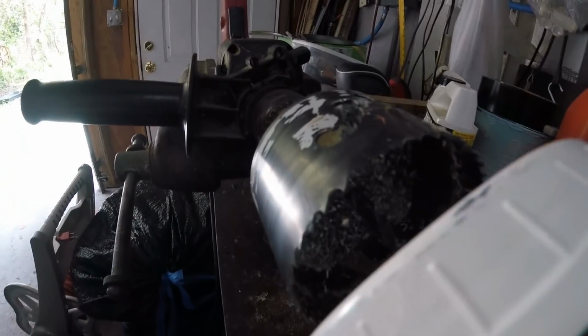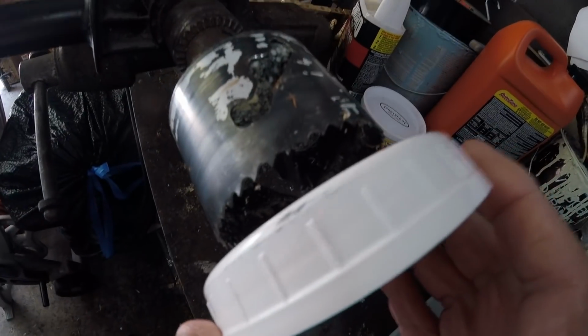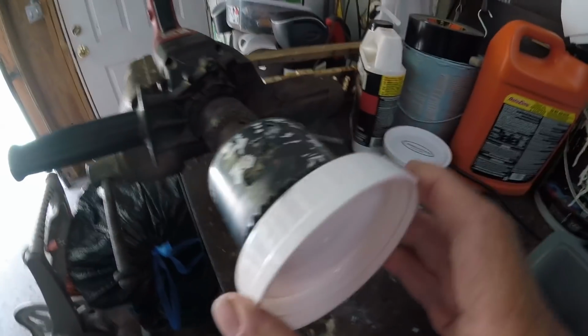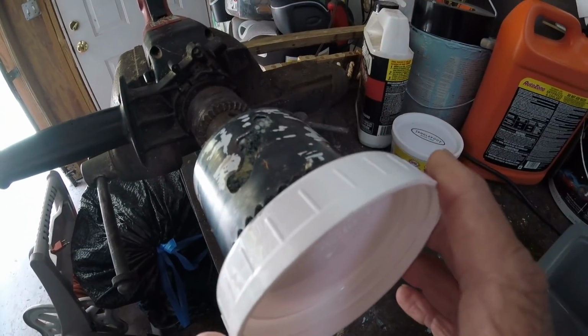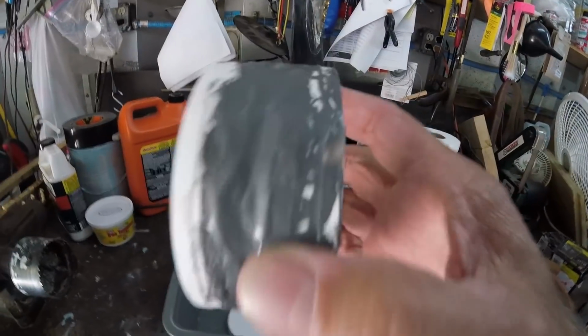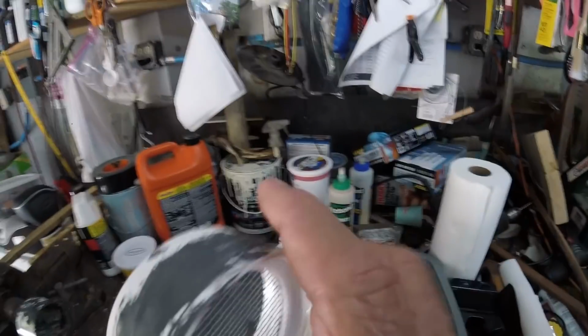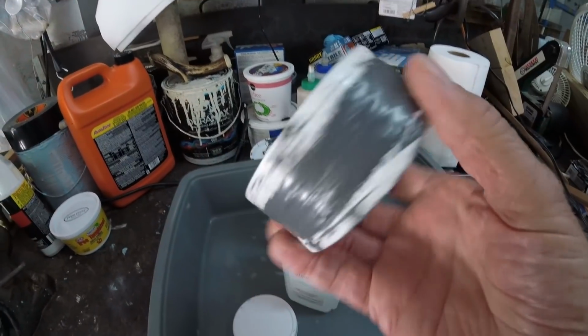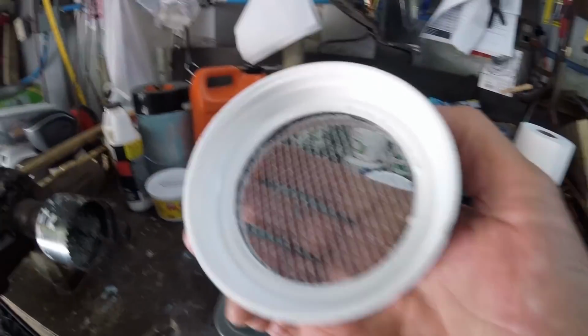And then you carefully just set that in there, right there in that hole, and go in slowly. And your fingers are on the outside here. I know this looks intimidating, but if your fingers are on the outside, just go slowly and that'll cut out this hole for you. Cut two of those and then go over to your wire wheel and rough up all the mating surfaces.